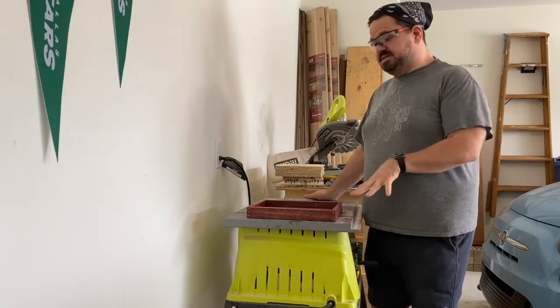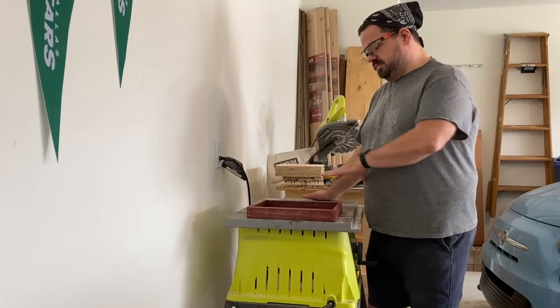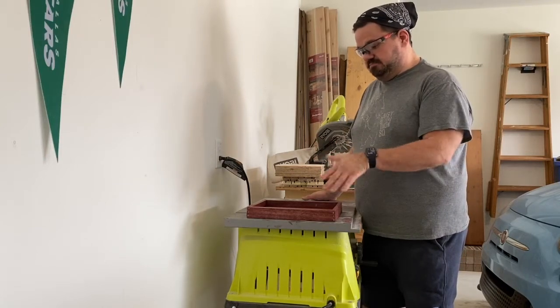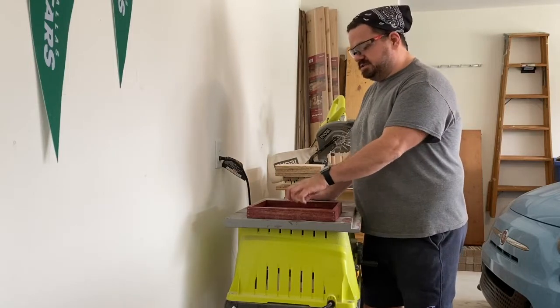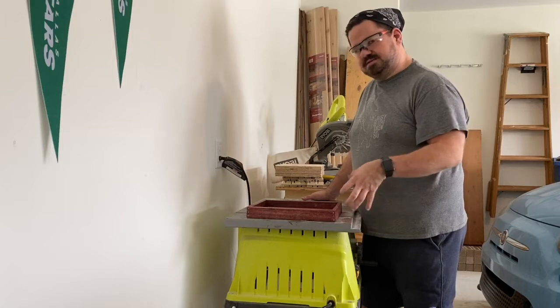So we have finished sanding it, and I have stained it. I didn't want a heavy stain, so I went ahead and did 2 quick coats. I let them dry about 5 minutes each, and then wiped them down with a cloth, like an oilcloth that I have, that just kind of leaves some of it and takes away the excess.